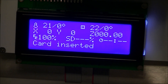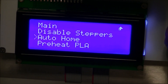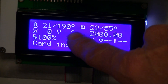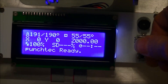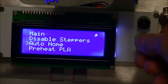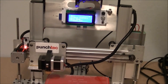We need to heat the extruder to make sure any dried filament will not impede our calibration. Press the LCD button and scroll to the prepare menu. Then turn the knob and select Preheat PLA. You will see on the LCD screen the extruder temperature is set to 190 degrees, and to the left, the actual temperature. Once the temperature is reached, click the button and go to the prepare menu, then select Auto Home. You will now see all the axes go to home position.